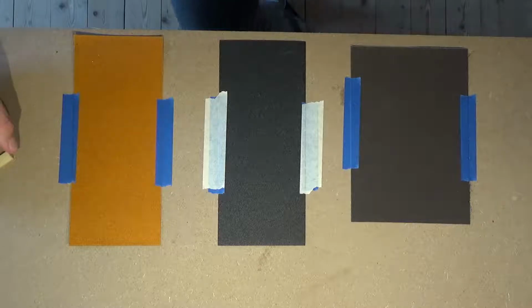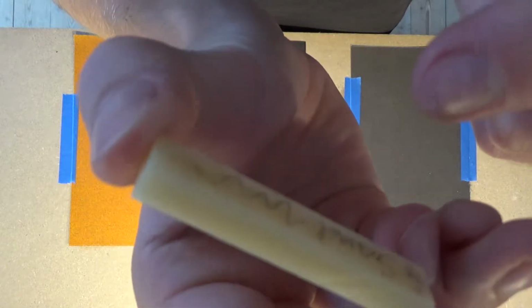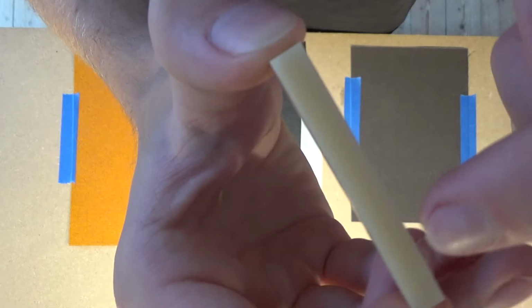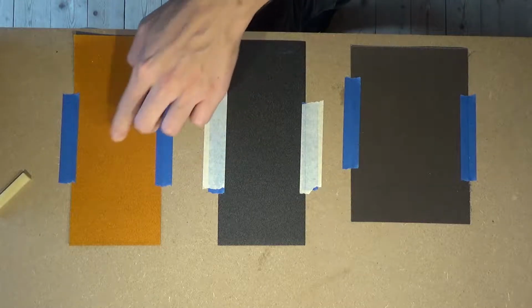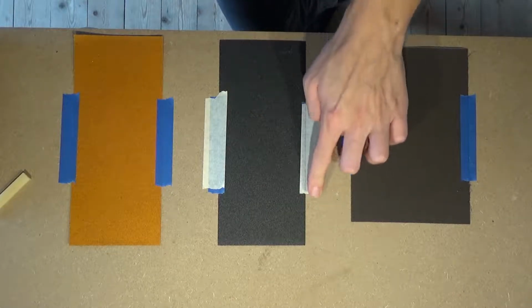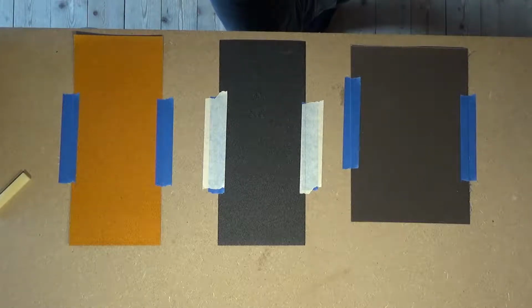And if you remember, we've drawn in a line with our caliper. Don't know if you can see it, but we have marked a line with our digital caliper, and this basically shows us a line to shoot for when we're going to sand the thickness of the knot blank down to what we need. And right now I have lined up 3 pieces of different grit sandpaper here, and this is basically what we're going to use to take the knot blank down in thickness.